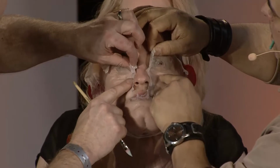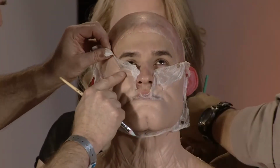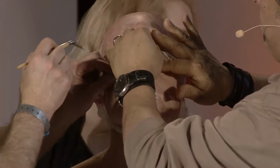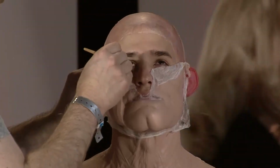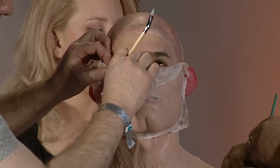So yeah, it was all fiberglass molds, and then we release. Ultimately, we just mostly use a Vaseline release. It's just the simplest thing. After all the messing around with various layers of things, I find the thing that works best, especially on things like fiberglass, is just Vaseline. Just straight up Vaseline. Everybody's trying to find that perfect release.